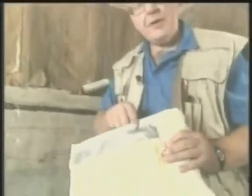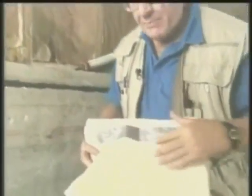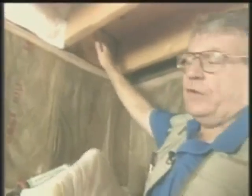Take the kitchen garbage can liners. This is a white plastic bag. Put in a piece of insulation that's going to be adequate to fill in between the joists. Fold it over and duct tape it. Then slice the back of the bag because that's for air movement in the event there's any moisture that was entrapped in the bag at any time. On the back side or inside surface of the plastic bag, now it's nice and smooth, all ready to go up and be installed between the joists up against the ribbon into the bed of acoustic sealant.